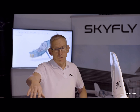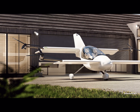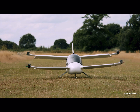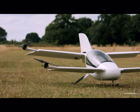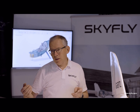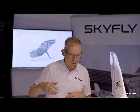The canard is set up with a bit of dihedral, which helps the propeller ground clearance. There's also a slight amount of dihedral on the motor pylons as well, and that increases the ground clearance as well as tending to move the downwash from the rotors further outboard, which helps to increase the effective span. The aircraft is designed to be quite stable on the ground.